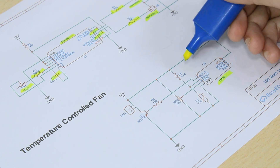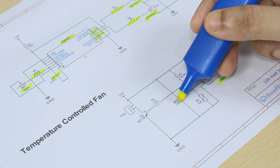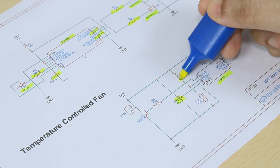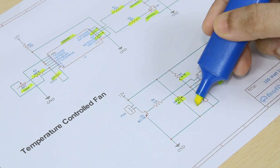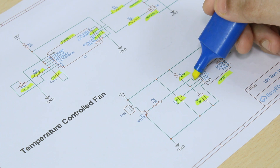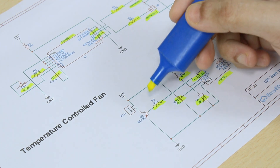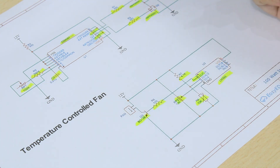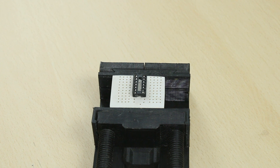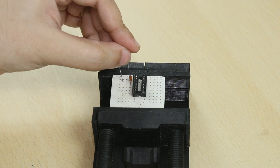The temperature control fan for cooling the MOSFET circuit is built upon an LM393 op-amp IC, which acts as a voltage comparator. A 10k preset resistor is connected for setting the turning-on point of the fan. The 4.7 kilohm resistor along with the 10 kilohm thermistor acts as a voltage divider. The output of the op-amp IC is connected to a BD-139 transistor for driving the cooling fan.